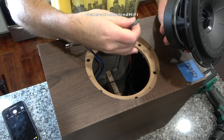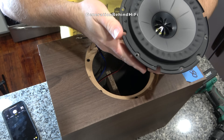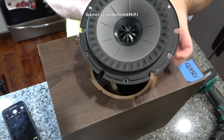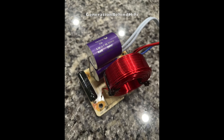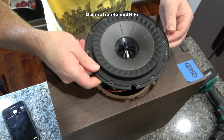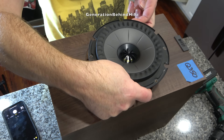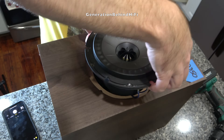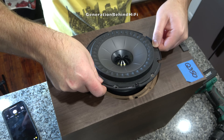After each upgrade I did, I compared the stock speaker to my modified speaker to see if I could hear any differences along the way. There were some changes that were minor and some that were quite audible. The biggest sonic improvement came from lining the inside walls with damping material, as well as swapping out the iron core inductor with an air core inductor — these upgrades really improved clarity. Voices and musical instruments are more natural sounding with better detail. The best analogy I can give: imagine talking with your hands in front of your mouth — that's the old speaker. Remove your hands, and you'll hear a dramatic improvement in clarity — that's the speaker with the upgrades.